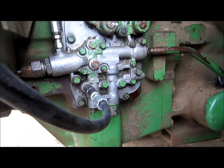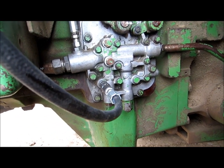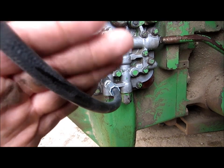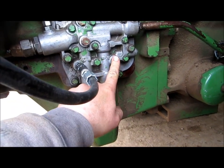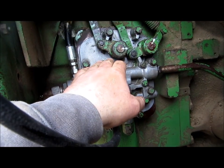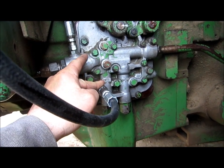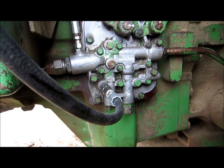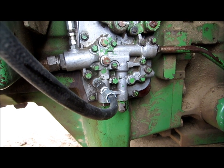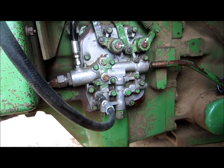If we did need to make a change here, you can't shim up the PTO pressure independently to my knowledge, because the PTO pressure should be almost the same as your system pressure. If you had to bring up the system pressure, you'd start here on this regulating valve and shim it up with some washers — John Deere has washers, but I've used just flat washers. Go a little at a time and see what happens. Some of these old tractors might need shimmed up quite a bit, especially as springs get weak over 40 years — you can also change the springs as another option. That's a little peek into the workings and simplistic design of these tractors. If PTO clutch pressure had been low but clutch-side pressure was good, we'd know there's an internal transmission problem leaking off oil, regardless of whether that lever arm is broken. Thanks for watching.